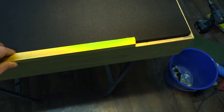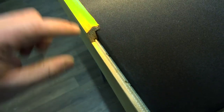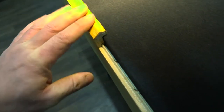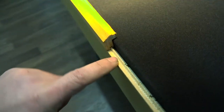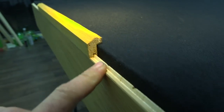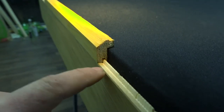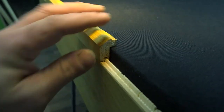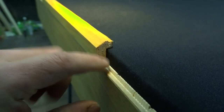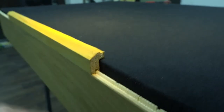This will be installed like this. Here on the side you can see how it's built — this edge is evenly just touching the black textile with an extra one millimeter, just to push it down a little bit. And here I have a tiny bit of wood section — about five millimeters — which helped me to close the box itself and make sure the dust and glass fiber materials cannot escape from the box. It also has a bit of an acoustic function so sound cannot escape or go in from the side. The black area is about 97 centimeters height and 63 centimeters width, where the sound can go in.